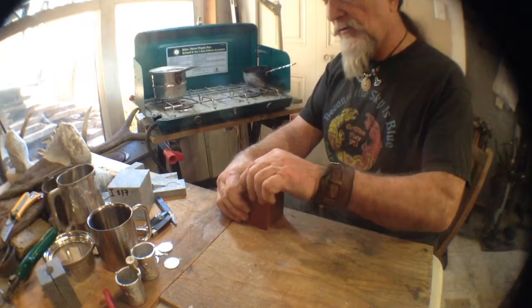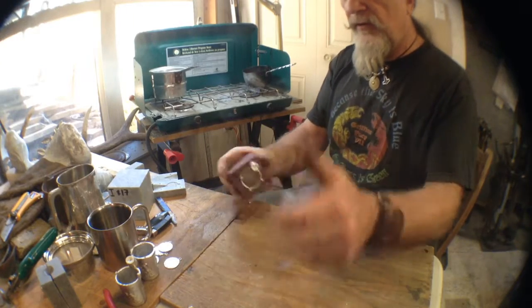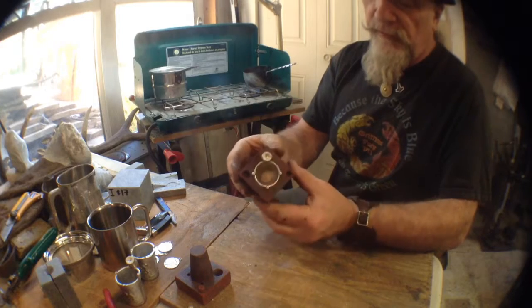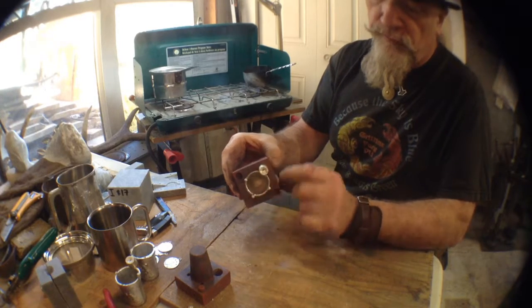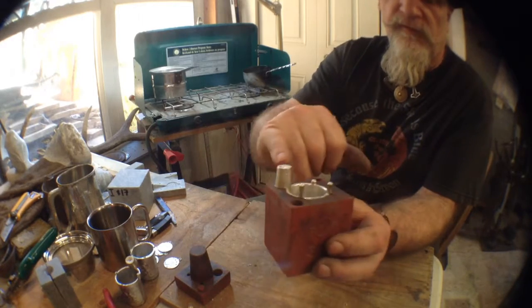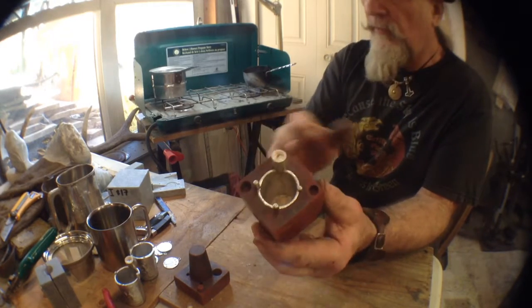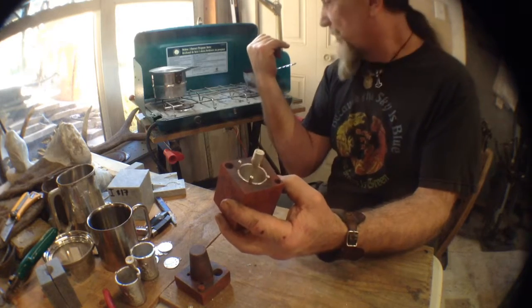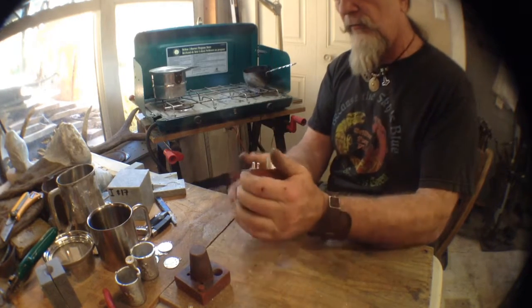Okay, I'm going to begin popping this one. There's the first part out. Now you can see a beautiful example there. You can see our 3 air holes, the 3 smaller little pegs that are exposed there. And then you can see where our big pour hole was. And what I'll do with that too is I'm just going to end up cutting those off and throwing them right back into our pewter cast.